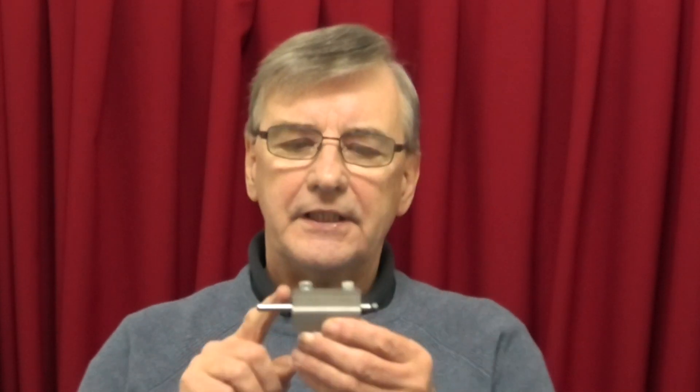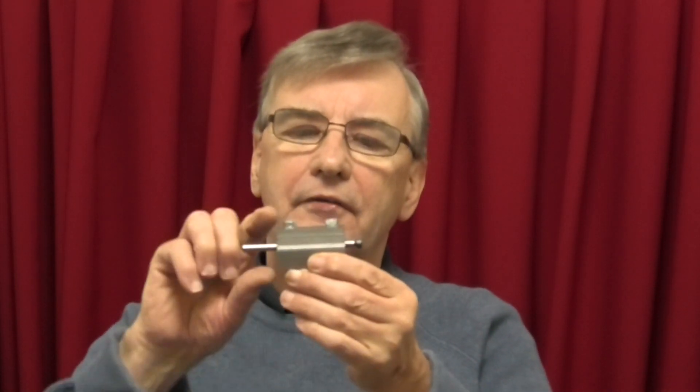Hello, welcome to E-Nuts Engineering, I'm Alan. Today in the workshop we're continuing with the Hemingway Boring Bar Kit. Last time we made the cast-iron blocks and the clamping bolts. This week we're making the boring bars and the tool bits. Now there are six boring bars: three with a 45 degree angle for the tool and three for thread turning which has a 90 degree angle to the tool. So let's go into the workshop and see how we do it.